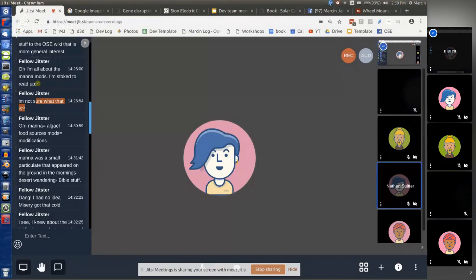it's about the time when that, I don't know if I can even explain it, but that time when it's waiting for the second measurement, if you're not careful within the loop itself, it's actually going to the next command in line. That seems like that's what it should do. But the point is, if you don't wait until that 20 milliseconds pass, you can skip a step in the control sequence, because the condition of low pressure when you move cylinders is not met. So it's actually a little subtle, but bottom line being that you need to add a small delay between steps to make the code work.